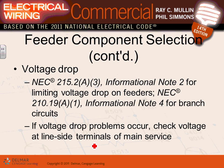Any questions about harmonics? A lot of engineering firms, Derek, here's the rule of thumb. If you have a lighting and receptacle panel, up to a 225 amp panel, they put in a full neutral. Four out, so four conductors, four out, up to a 225 amp panel. Higher than a 225 amp panel, they start derating the neutral by 70% based on the code.